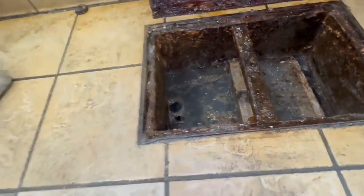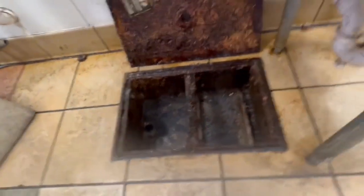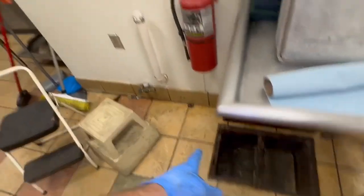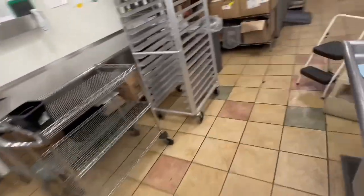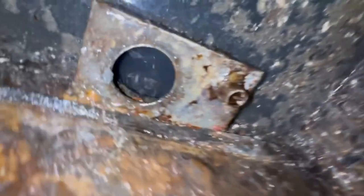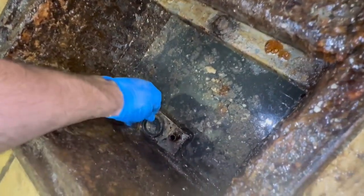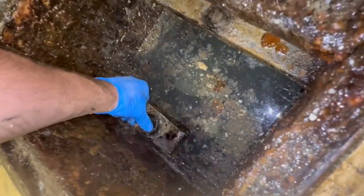That's good — it's not going over now. It should get cabled or jetted on the outlet side. It's about 85 to 90 percent efficient and it's working good. We'll schedule a return with the jetter for jetting on the outlet downstream.